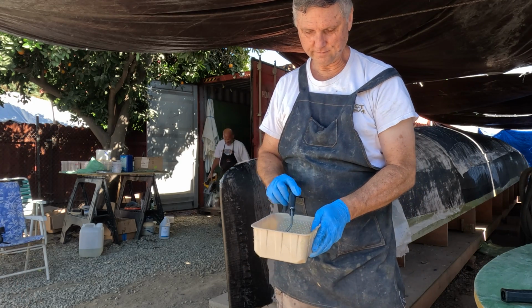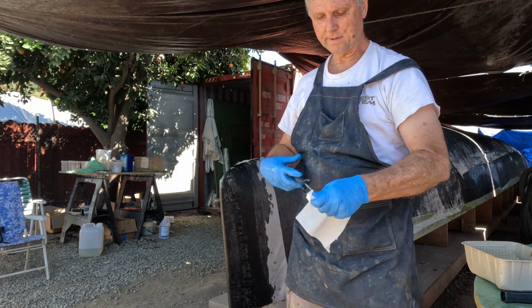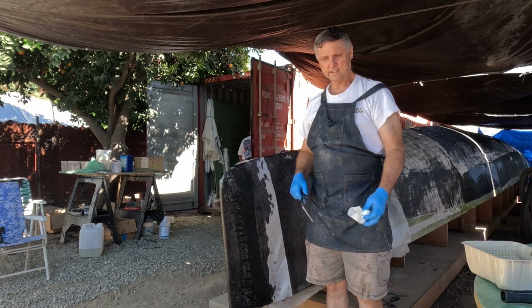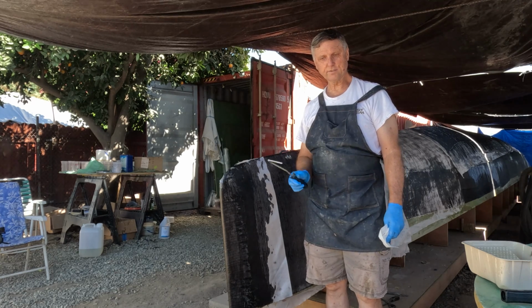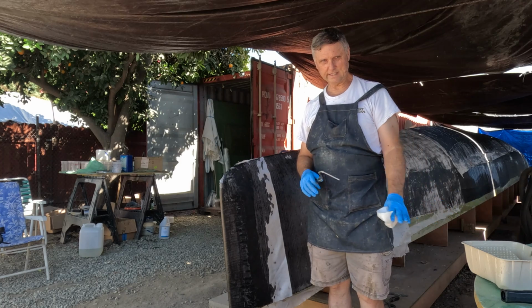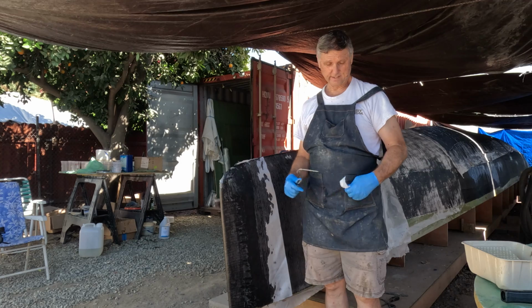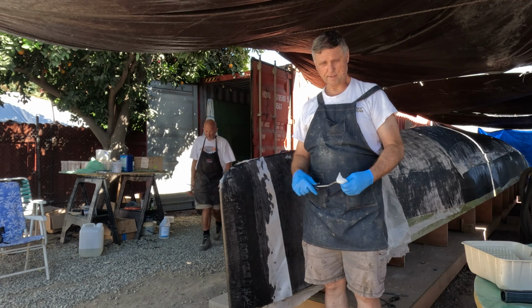The next thing we're going to do is something I've been promising for a while. We're going to make up some squares of foam, and we're going to put basalt on one in the same layers as the fiberglass on the other. Same biaxial weaves, all that, same exact stuff. We're going to use however much resin they need to wet out properly, and that won't necessarily be the same because the basalt may take less resin, but that's just part of the test. So we'll wet them both out to the proper level of how much epoxy needs to be in there.